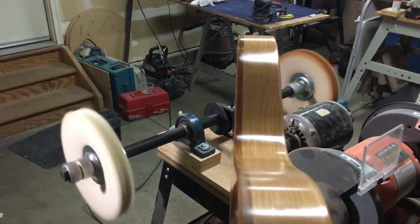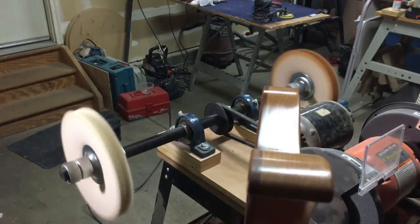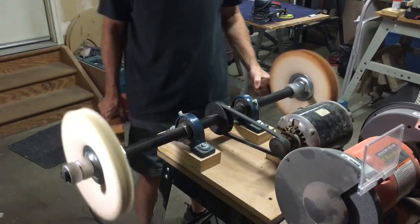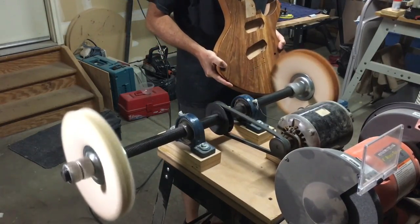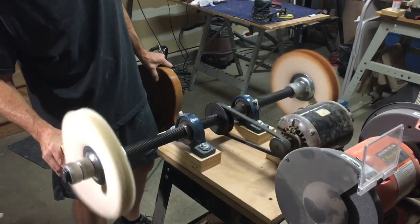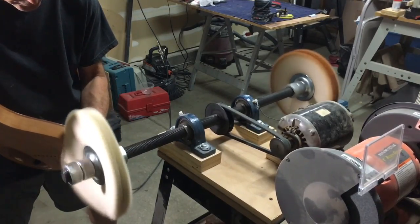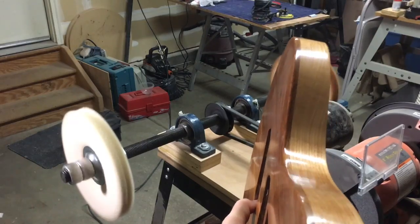This is how the surface looks before buffing it, and hopefully the video will show that there are some very subtle streaks left by the rag when I applied the polyurethane. I'm going to start using this wheel, and I'm going to be using a Brown Menzerna coarse polishing compound. And then this is how the surface looks after polishing it on the buffing machine.